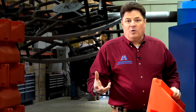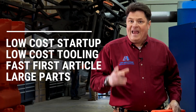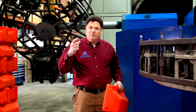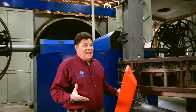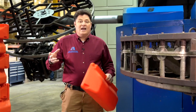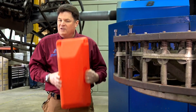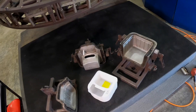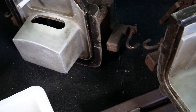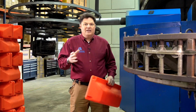The advantages of rotational molding include a low cost startup, low cost tooling, a very quick resolution to see what kind of parts you're going to get, and the parts can be extremely large or extremely small. All we need are motion and heat. Rotational molding at Ash Industries is truly a unique operation. Most of the forming we do is high pressure — high pressure thermoplastic, high pressure silicone, high pressure metal injection molding. But rotational molding is unique in that it is a low pressure process. In a low pressure process, your tooling does not have to be as substantial. You can have a thin-walled aluminum cast mold, which is significantly less expensive, and yet makes products that cannot be made any other way.